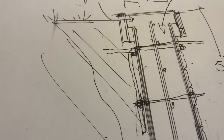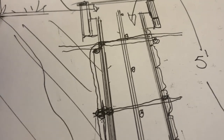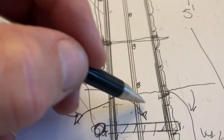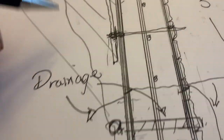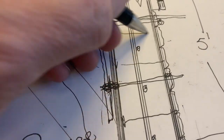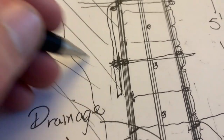Another thing you do is do more of a dry concrete. Don't do such a wet mix, and you can have it pumped, whatever. Even if you did a 4-inch slump or 3-inch slump, it's more than good. Remember, you're not gonna get efflorescence because the panel will stop that. Of course, it'll all seal that up in here. You have your drainage, so you're cool. Another thing you do is put some spacers in here, like some rebar spacers, so it doesn't collapse. It doesn't go in. And what you do is you backfill this dirt.